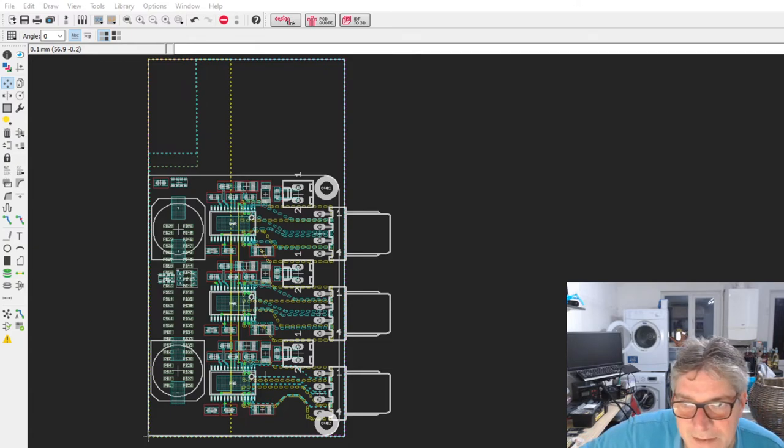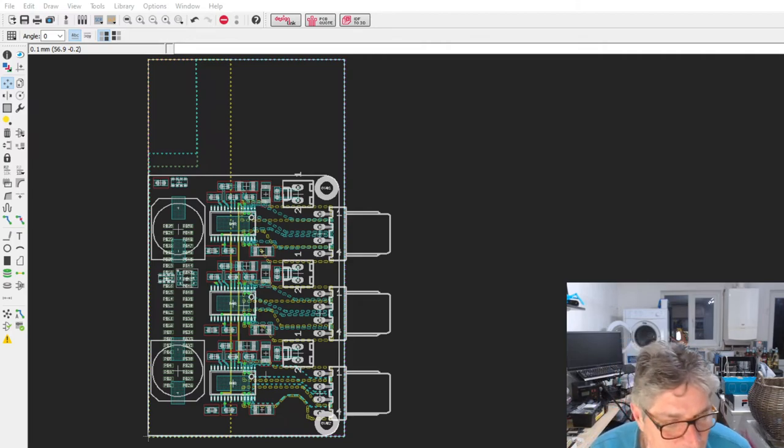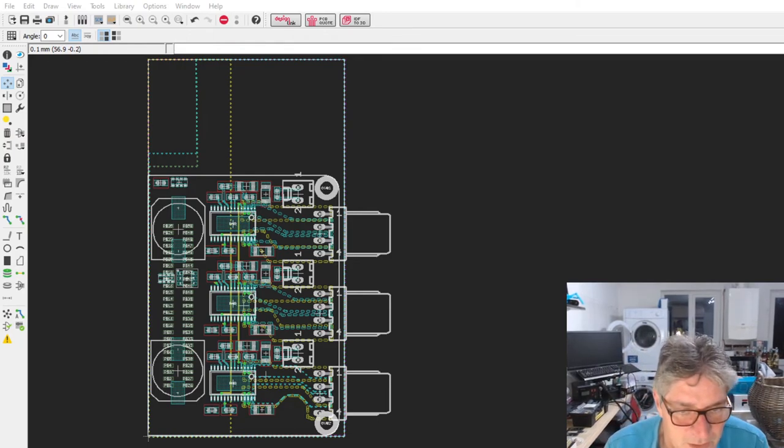Those use those standard keyboards. You can buy those. And you just drive it by column and row. How many's on there? So you've got 1, 2, 3, 4, 5. So you've got 16 alphanumerics, and then you've got an extra 8. So yeah, you could do that from one tile, one of those keypads. The keypad itself, I don't think would fit in because it's a bit too big, but you can get those kind of keypads with a ribbon cable or FPC cable on them, and that itself could then connect to the tile. That's another possibility.